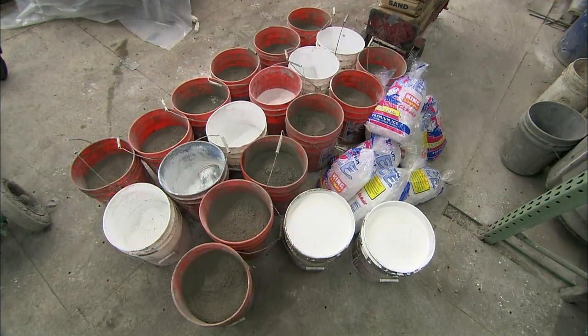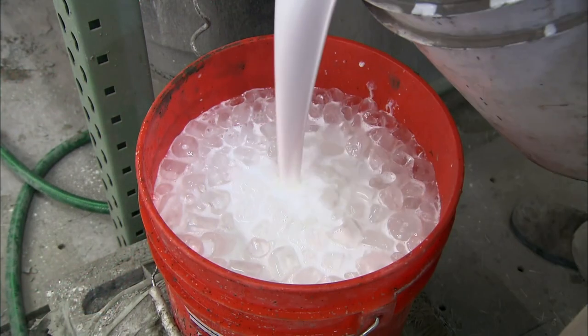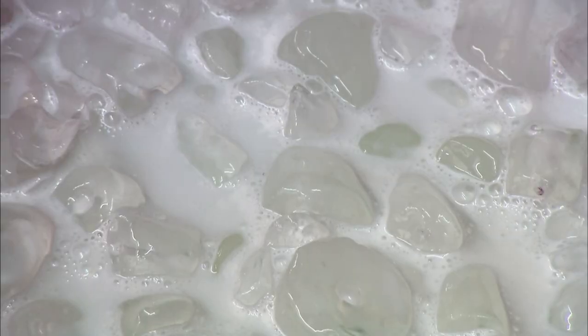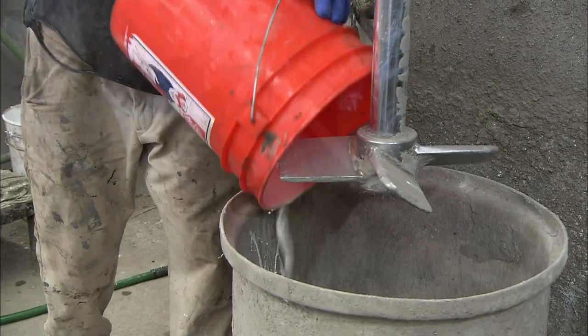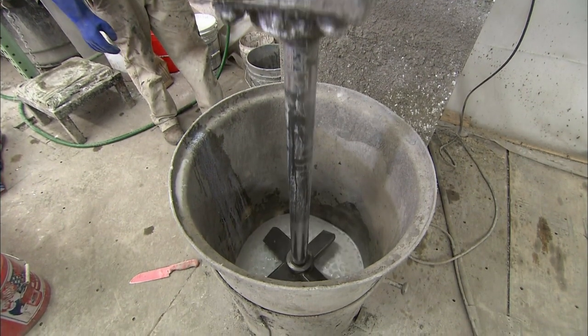To make a rock realistic wall, they mold cement panels to attach to the steel frames. To mix the cement, they combine ice and liquid polymer. Ice keeps the cement from overheating in the mixer. The polymer is a binding agent, and it also makes the cement flexible so the wall doesn't crack or chip.